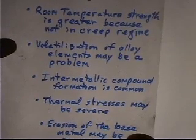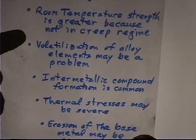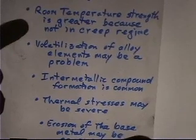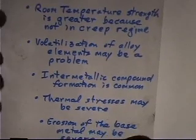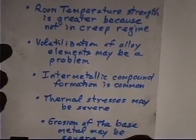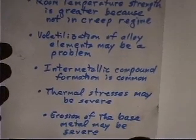just like I consider solder joints never to have a strength of more than about 1,000 psi in service. Braze joints, I usually figure, can take about 5,000 psi. And in certain cases where we get thin joints and contact strengthening, braze joints can take 40,000 psi. So it's getting up to be as strong as a weld in some cases. Although don't count on that 40,000 psi too much. It can be achieved, but only in certain cases. Typically, 5 to 10 ksi is the typical strength of a braze joint.